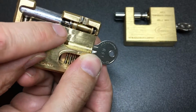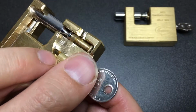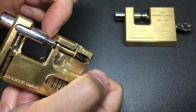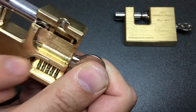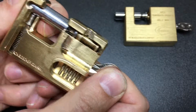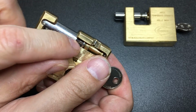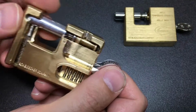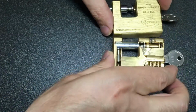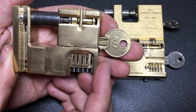What you can't see in this lock is what's keeping the whole thing from locking up, and there is actually a mechanism here for a ball bearing to be released from the cutout once the actuator at the back turns. You can see the cutout on the actuator which will receive a ball bearing or bar, depending on what type of lock this is, moving it out of the way of this cutout in the shackle. So altogether pretty cool. Now, I'm just going to put these two here together so you can appreciate them side by side for a minute while I bring in the Sterling.